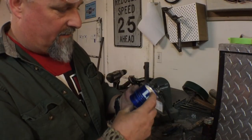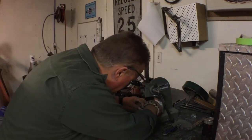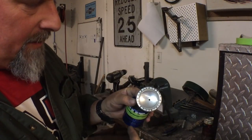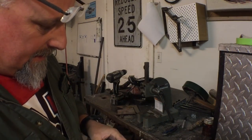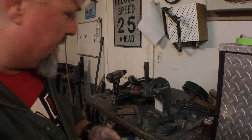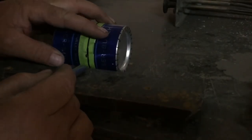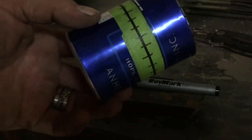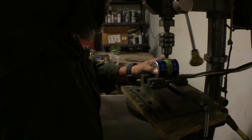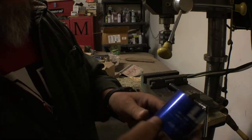Pressing the two together, you should end up with something like that. Pinch that over. Measure down five eighths of an inch from the top crimp and make a line. Now the tool I made — I marked it out in 24 equally spaced increments. Slip it back on until it hits the tape, line those marks up with the plate, and transfer the marks over to the other side. Then take a sixteenth inch drill bit and drill a hole at each intersection. Important side note: don't drill into the center section — only drill through the outer section. You should end up with 24 jet holes.